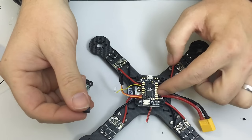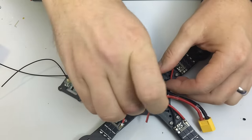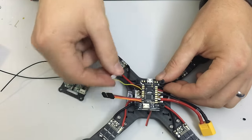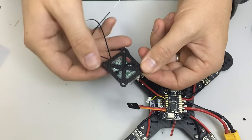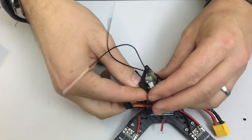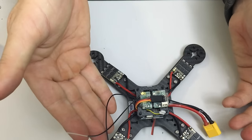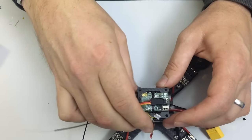I'm temporarily building up the stack — I haven't finished with the flight controller yet. I've taken some short standoffs to hold the flight controller in place. I've soldered a servo lead onto the flight controller for the receiver input and also the telemetry wire. I've taken the receiver and cable-tied it to a carbon fibre plate that has to be purchased separately — it doesn't come in the kit. It's going to come up through there, plug in, and sit over the top. That's how I judge the cable length and how it will end up sitting with everything screwed down.